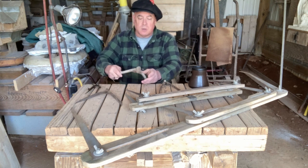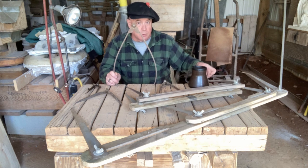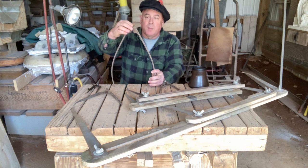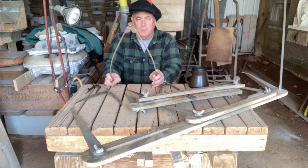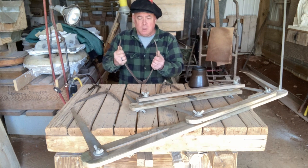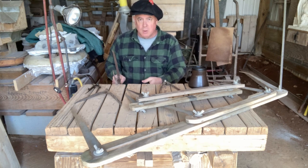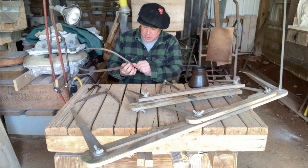These are expensive, but you can make your own — just take some of these ends, bend them the same way, and make your own compasses. It's not rocket science. Put a bolt with a nylock nut, some washers, some brass washers to lubricate it, and play with your tension so that they open and close well without too much resistance, so you can get to those really fine dimensions. You'll end up tapping them to fine-tune it. You've got to pay attention — you can't bleed on the stone.